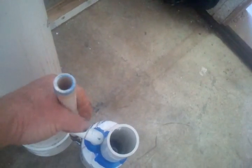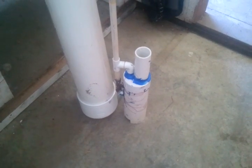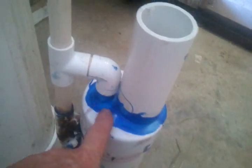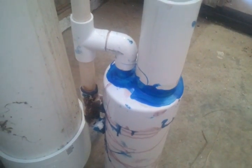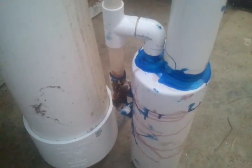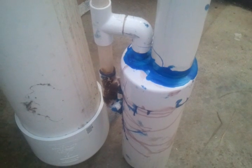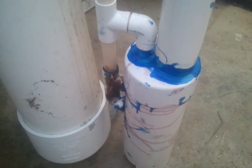Okay, so I did some tests. This one at a depth of 27 inches with a lift of 9 inches. That's a total of 36 inches: there's 27 inches from here to the surface of the water, and then from the surface of the water to my measuring can was another 9 inches. Okay, so pumping full bore from a 200 liter per minute air pump, which has a head of 7 feet, so there's really probably not very much head loss going down at 27 inches.